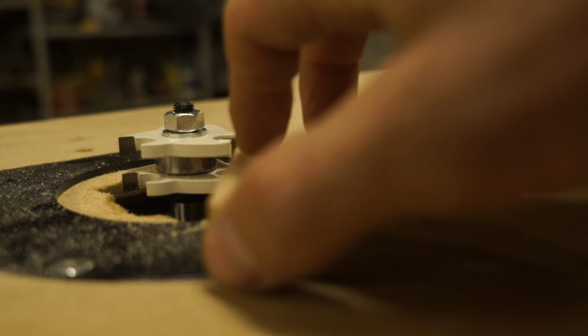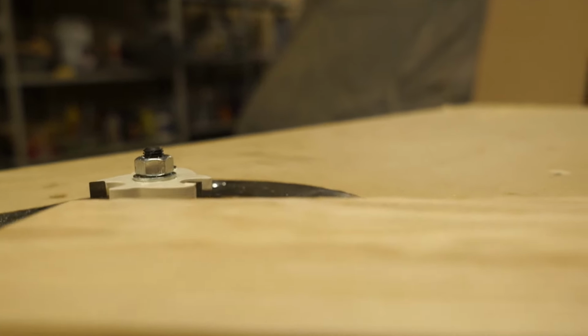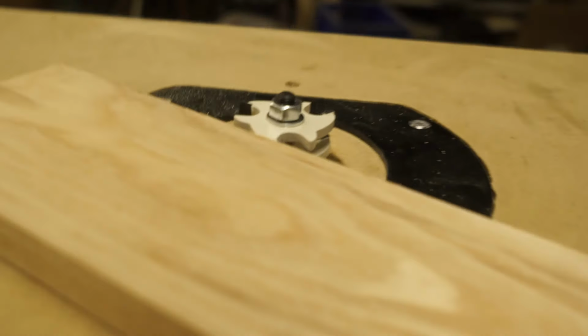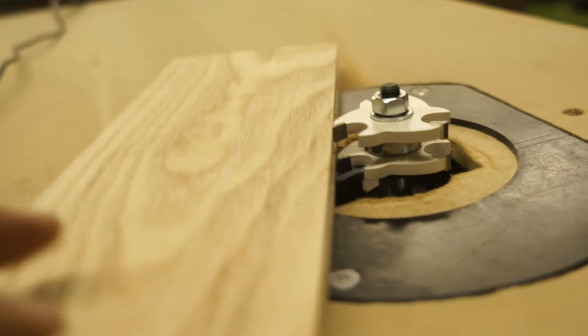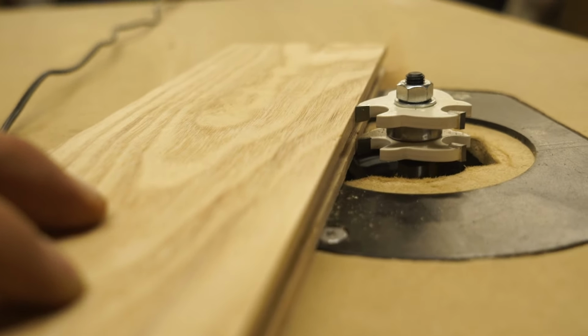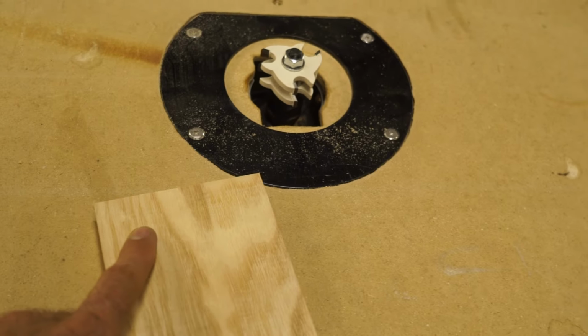It's difficult to see. It's wrong if I line up around there, or if I line it up to the blades here. I have to line it up where the material is going through the cutter, and you'll just have to believe me that that is bang on. So right now, I think this is the really scary bit because it's on the end grain. Now I'm going to cut the tongues on these rails.